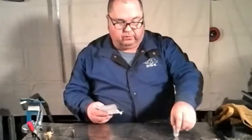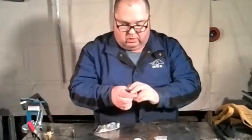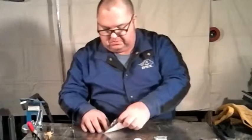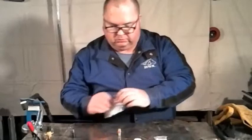Let's look at the parts for our gas saver gas lens — this is for the 17 style torch. The first thing we have is this little Pyrex cup. Next we have the new insulator, and then we have this collet adapter part with the screens in it. This is the new jam collet. And our collet body has this nice big O-ring on it to seal everything up.